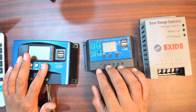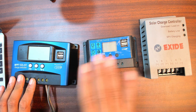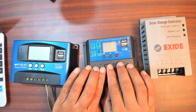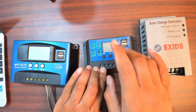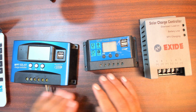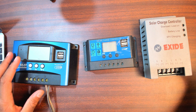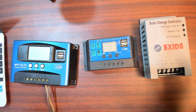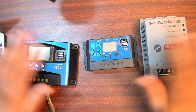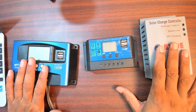This one is my least favorite because it's sold and designed to resemble an MPPT solar charge controller, but in actuality it's just a regular PWM charge controller with a fancy screen and some logic that at best works if it wants to. The proper ones work perfectly well. These two are the good charge controllers - this one, not so much.